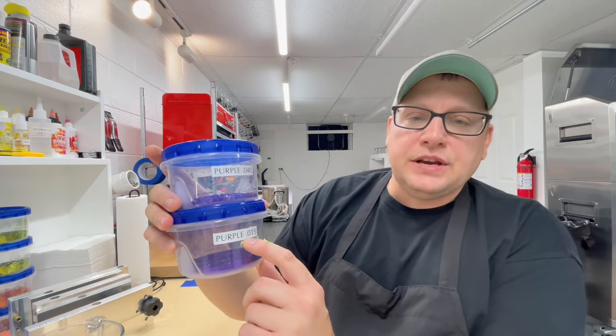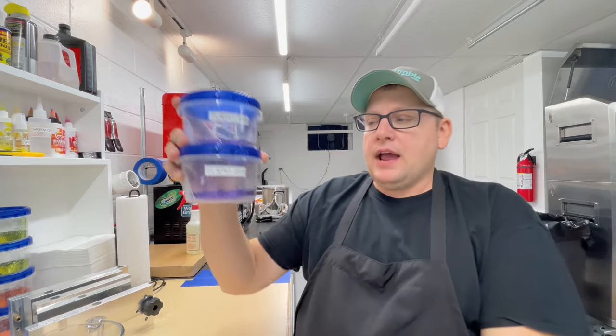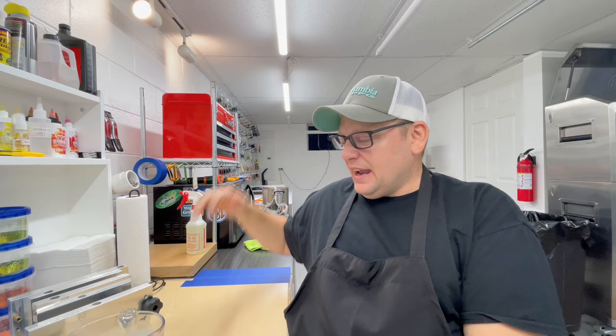And I'm going to use 2 different sizes, the 0.015 and a 0.040. I have these two in purple. I'm going to put a scoop of that and a scoop of that, and we're going to do that for all the other glitters there. I just counted them up a few minutes ago. There's 39 of them. So we're going to put 39 scoops of glitter in this 3 cups of Plastisol, mix it up, and just start shooting molds and see what kind of crazy baits these make.